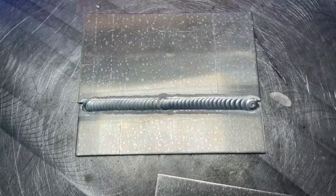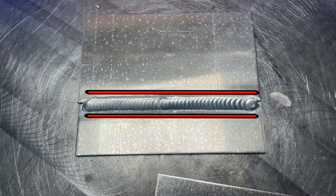So here are some things you can do — take a look at some of these details with your own work. The first thing we're going to look at is an overall bird's eye view of your width. Taking a bird's eye view of your entire pass, how was your overall control of your width and profile? Were things narrow at the beginning and as you approached the end, did they flare out and get a little bit wider? Take a look at how these variables went and then think about why this happened and how to prevent it. Your overall profile of your starts will tell you a lot, and if you really master and understand your starts, you can learn to control things when they become a little bit hotter and more difficult to handle, especially usually towards the end of a pass.